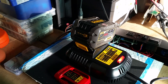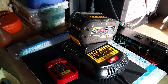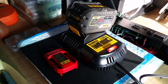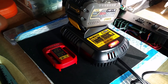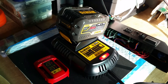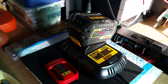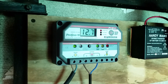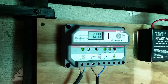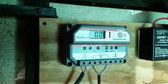Welcome back to another look at the DeWalt solar power setup. There's a bit of sunshine today, and I've got the 6Ah power battery being charged on the 12-volt car charger that I recently bought at the show — really pleased with that. The charge controller is the ProStar 15, and it's been putting out about 1 to 1.5 amps solar into the battery.